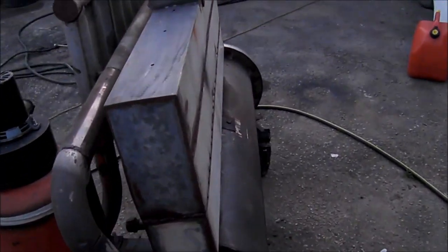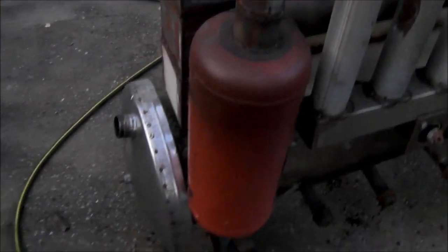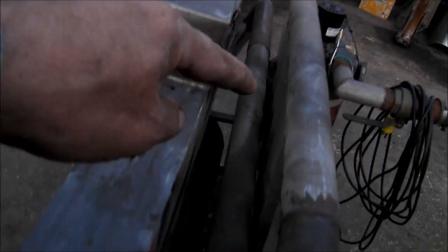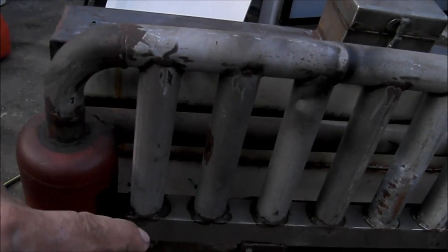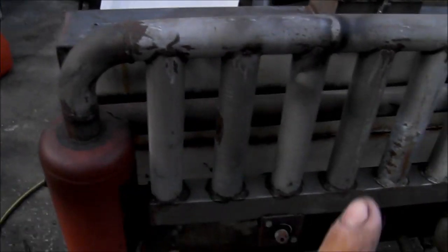It burns in those six pots that are in there, comes out this tube, and goes into this unit right here which is a cyclonic filter. This tube goes all the way to the bottom, about an inch off the bottom. So all the smoke comes out the end of the gasifier, comes down here, goes in, spirals around all the way to the bottom, and then comes up the tube and into the radiator. It basically does this S-curve through these pipes to pick up some cooling.